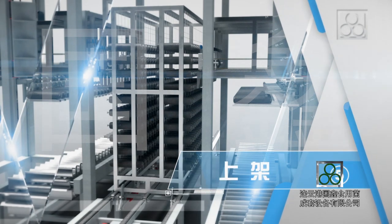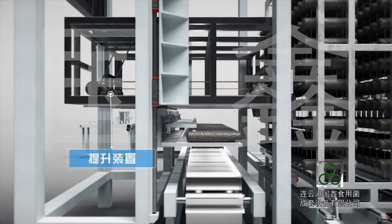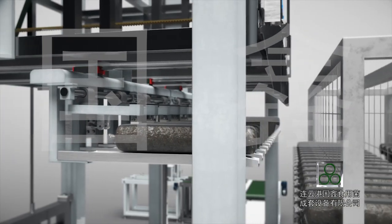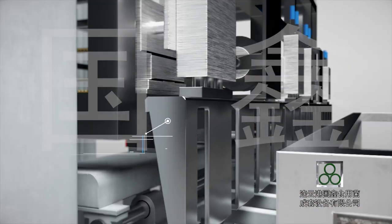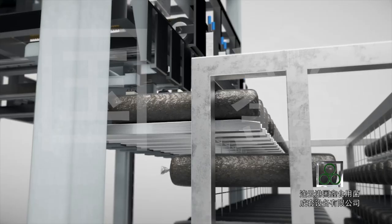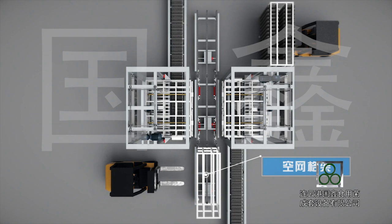Step 5: Grid shelf loading. The log support rod moves forward and goes to the back of the logs inside the V-shaped conveying trough. The lifting device moves and the log support plate supports the back of the logs, raising them to the grid hole. Both the log support plate and log clamping jaw carry the log to the grid hole. The log baffle goes down to block the bottom of the logs and then the log support plate draws back. The lifting device lifts the next batch of logs and plugs them into the last layer of grid holes in the grid shelf. When the grid shelf is full, it is conveyed to the next station for incubation.